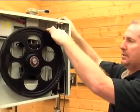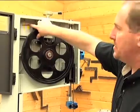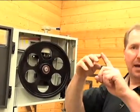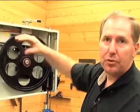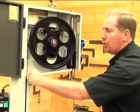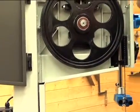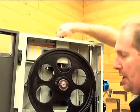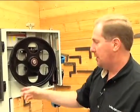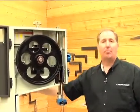Next, put the tension back on the saw by lowering the handle down and locking it in place. Now we've got just a little bit of tension on there and you'll see it starts to come up on the tension gauge. During the first installation, make sure that tension gauge raises up. The typical rule of thumb is you want about a quarter-inch deflection right here on the widest part of the saw — right now that's a little bit too much so we're going to add a little bit of tension. All right, I've got about a quarter-inch deflection. Typically I'd take a Sharpie and mark it on the gauge where I like to run it with a half-inch blade — that gives you an indication of your basic settings.